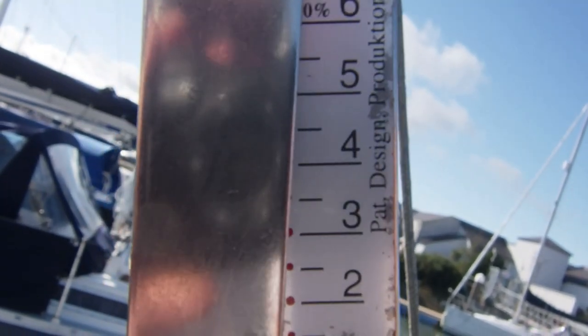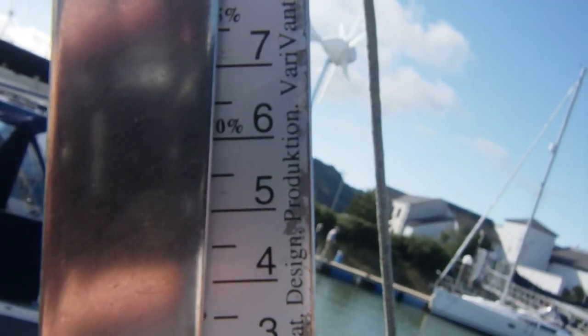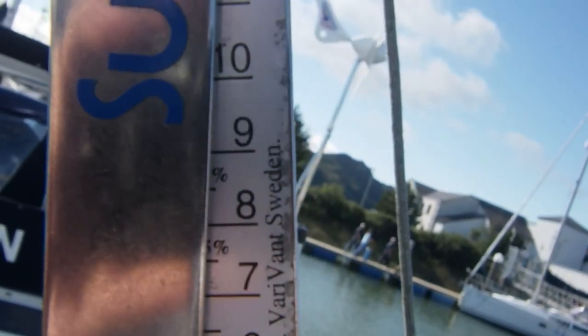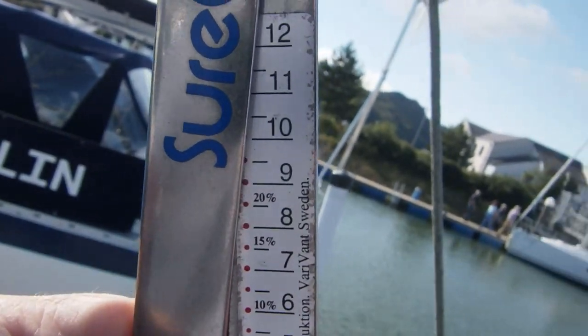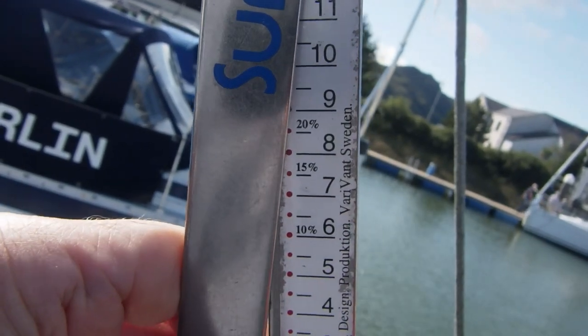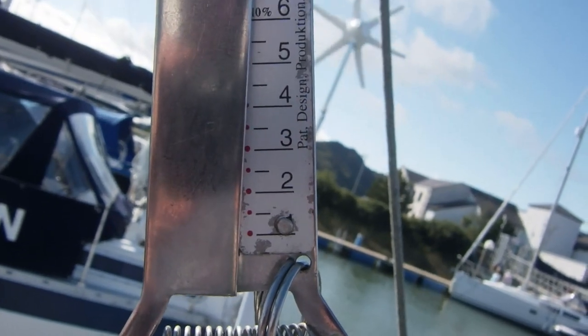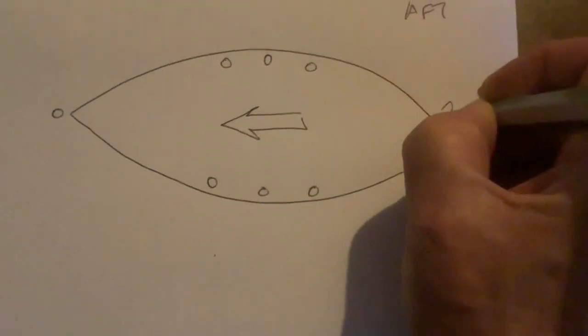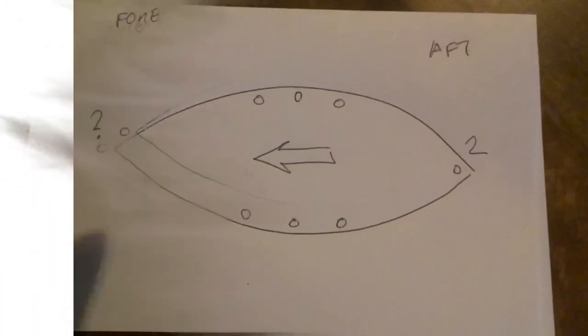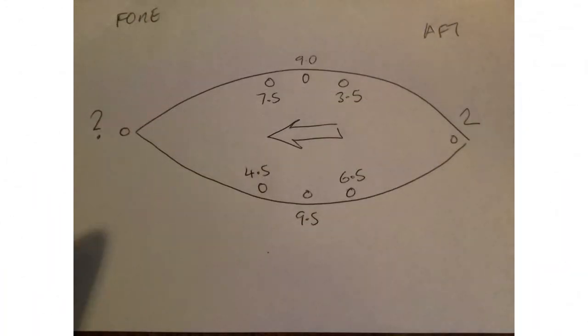Number 2 is the last full dot. 2½ has just been sliced a bit, and 3 is definitely sliced. Normally it wants to be up by 6, so this is actually quite slack. Rear stay: if I put pressure on with my hand you can actually see that 10% is at 6, 15% is at 7.5 and so on. Cruising boats run at about 10%. Then go to your diagram and put it down, then do the same with all the other shrouds. When you're finished you're hoping for a much better pattern than I've got - pairs should look quite similar. For example the cap shrouds should be the same, and these are 9.5 and 9 which isn't too bad.